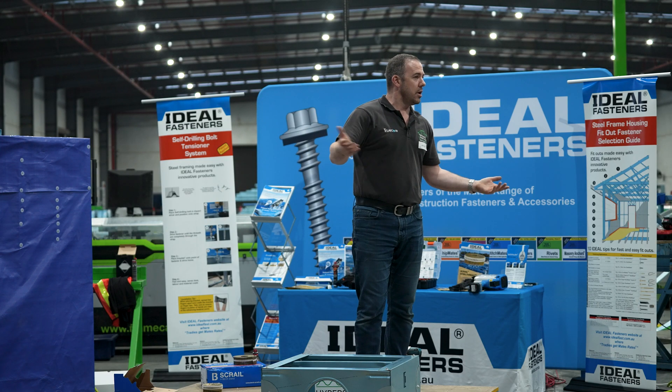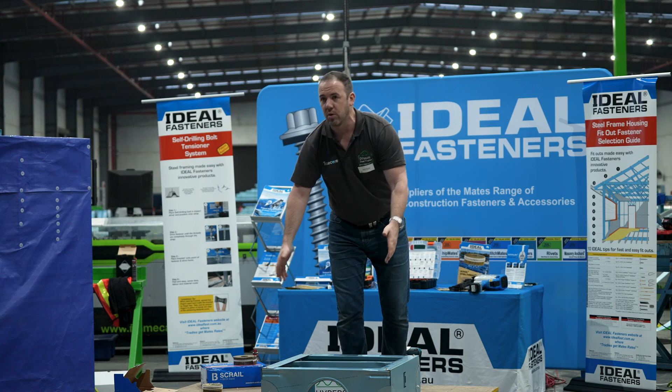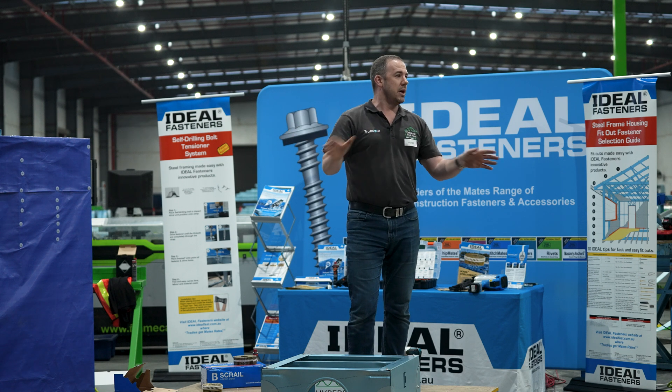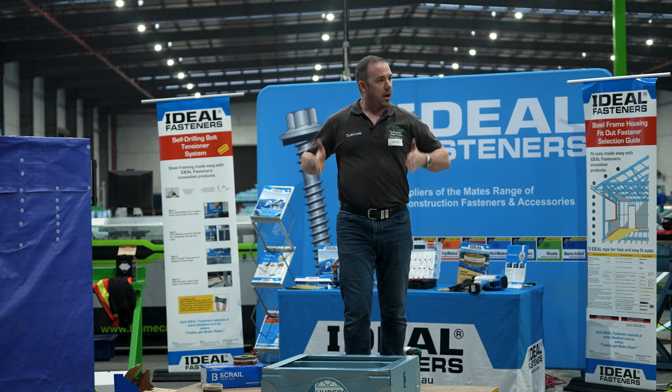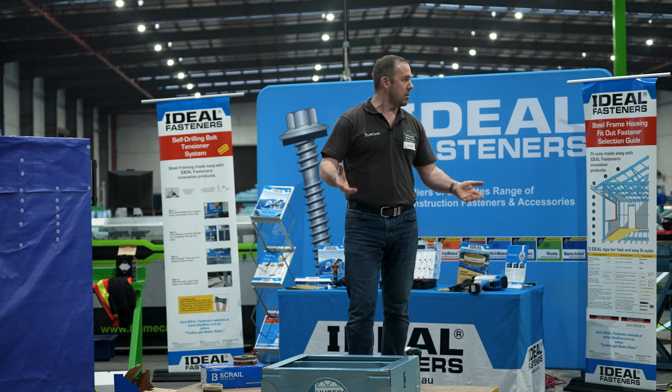For your townhouses, which a lot of us are building all the time, you put your perimeter beams on the party wall, you bash the tabs in, you bring your joist in, you put your screws in, you're done. Much less measuring on site. As long as your perimeter beams are straight, parallel and square, you can really speed up your job site a lot.